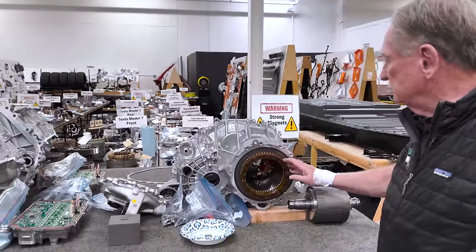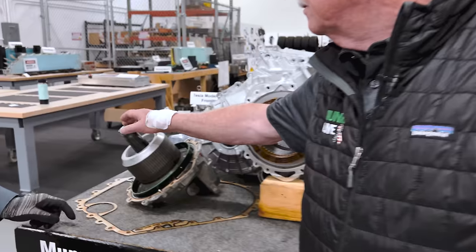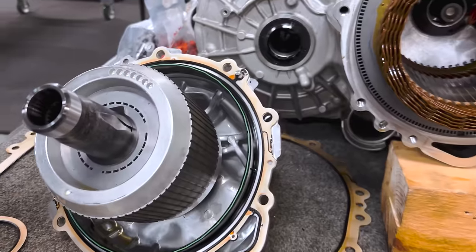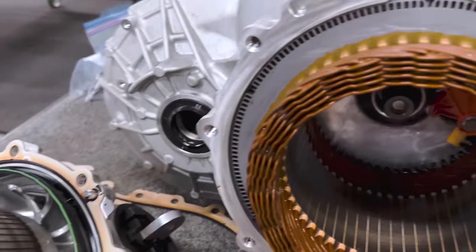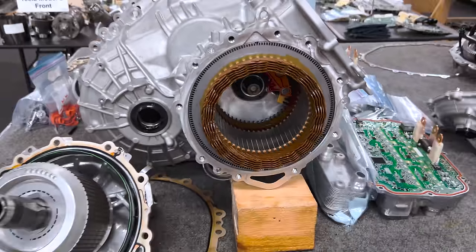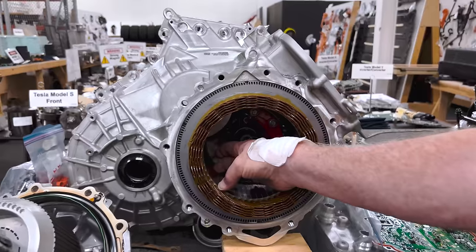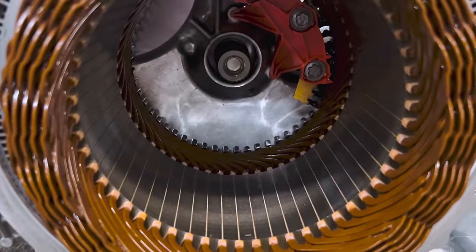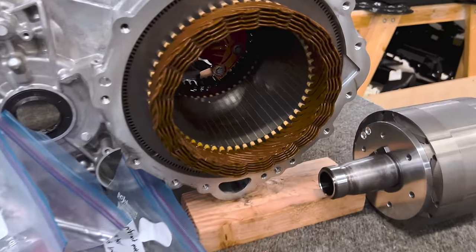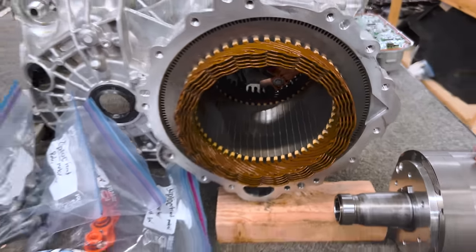What's also nice is that the diameter of this stator is the same diameter as the stator we have for the induction motor. Not only that, but they also look like they use a very similar winding pattern — we'll verify that when we get it apart. It's clearly similar tooling, maybe not identical, because the stack length for that motor is smaller and this one is quite a bit bigger, and this one does have quite a bit more power.